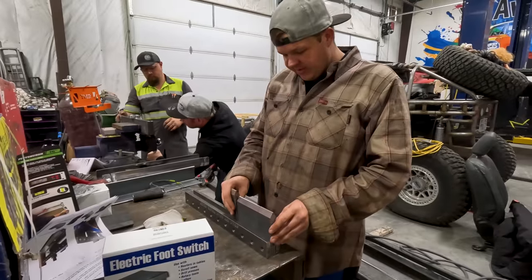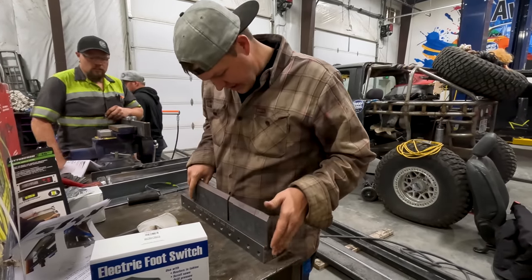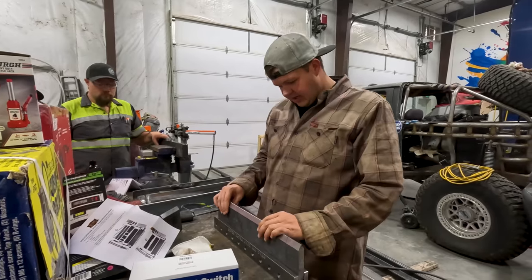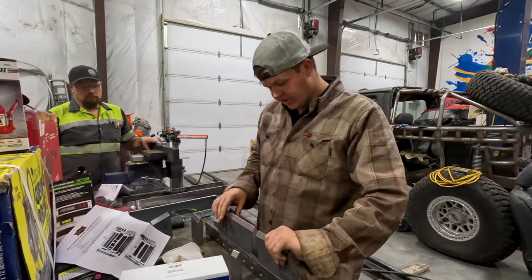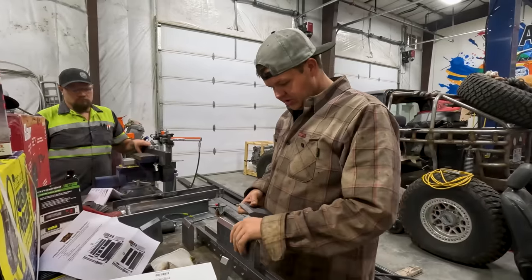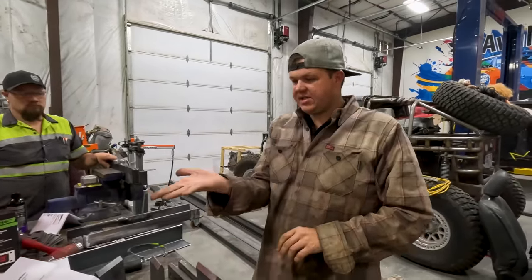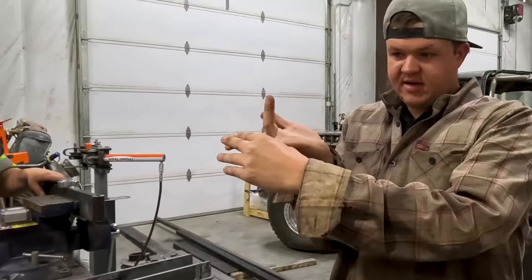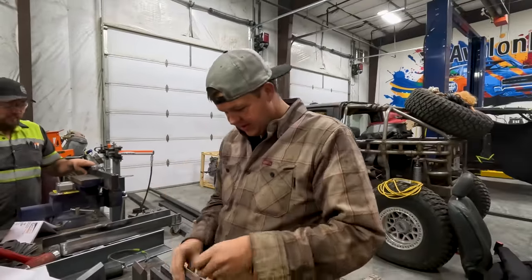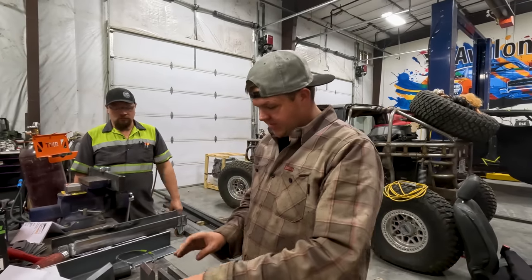So what I'm doing is I'm gonna put all of my finger dies together and then I'm going to bolt them together. I can take fingers out and I can use just that here or I can use just this here. So if you have something like this and you just wanna bend that, just imagine these are flat and you can use this. And then it keeps your metal flat, but only bends where you want it to bend.